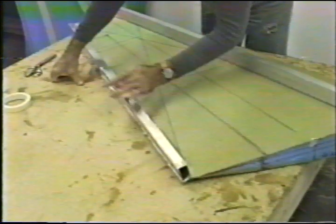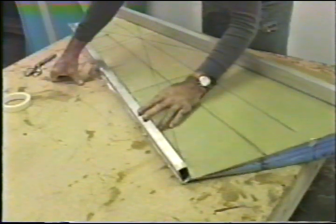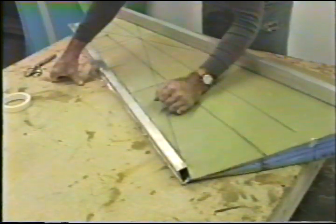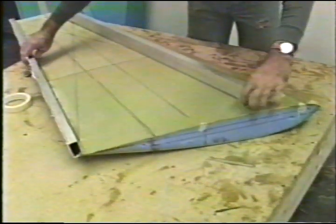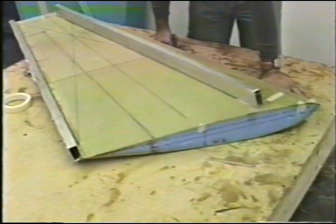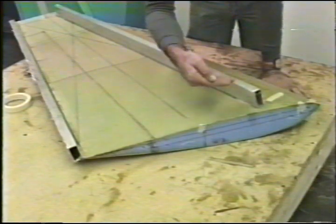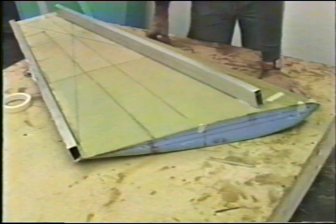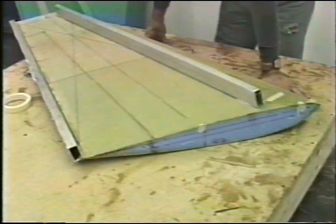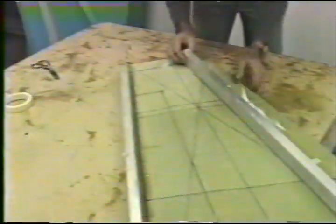They put small dollops of Bondo on a piece of extrusion far enough forward of the trailing edge that when they popped it off, it delammed the foam. And we run the risk of that happening in this area as well. So we have to approach this very cautiously. If we run something between the extrusion and the glass, we can depress the glass into the foam with whatever device we are using to separate the two. Especially more critical at the upper end, due to the fact that in this area we only have 2 plies of fiberglass. This is already debonded.